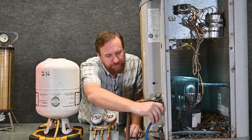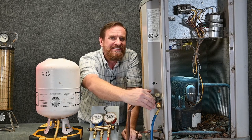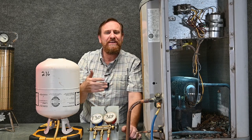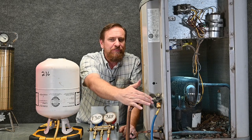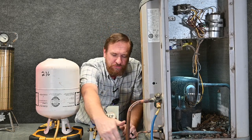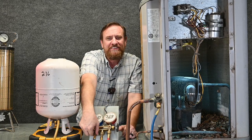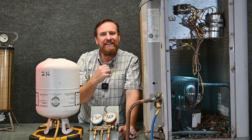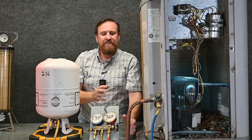Using only the two-finger rule, we're going to simply thread that on to the suction side. What's inside of this hose is dirty, nasty, stinky, polluted air — moisture, air, contaminants. So we're then going to loosen the connection right here, and the low-temperature, low-pressure, superheated vapor will push out of the unit through this hose and purge right here at this connection. Then we go ahead with our two fingers and tighten that back up. That's a purge for a very short amount of time — just about a second — and we push that vapor out of that hose.